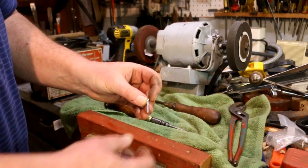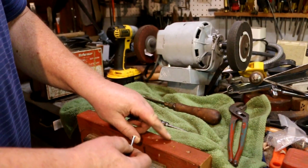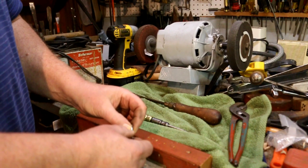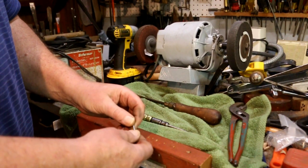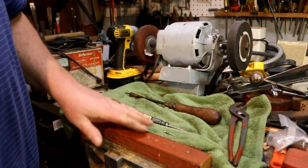Just for fine — gives it a shank clearance. Probably should have step drilled that. I should have probably drilled it with an 11/64 inch shank and maybe a 3/32nds diameter pilot hole. But you get the idea.